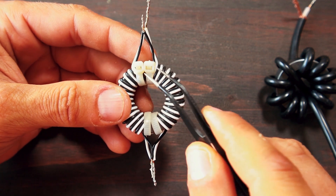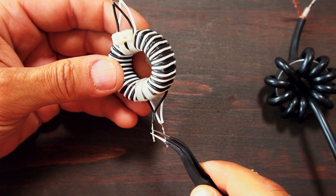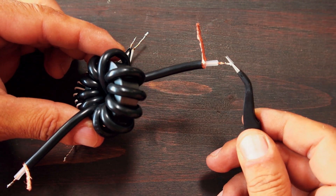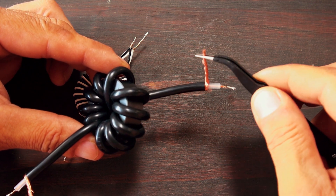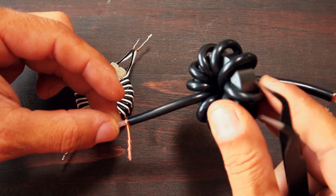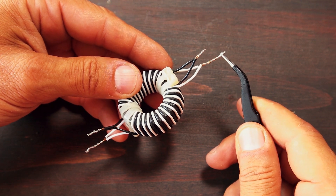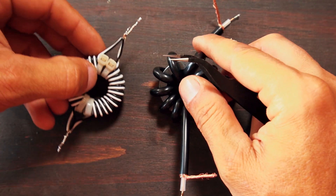I start on one side, end up on the top, then do the same thing for the other side, connecting the white wires together on one side and the black ones on the other. When it comes to connecting it to the coax cable, the center wire of the coax gets connected to the center pin of the BNC connector and the braid to the ground connection. I put two separate BNC connectors on each side. Same thing on this choke — the white wire goes to the center pin and the black one to the ground.